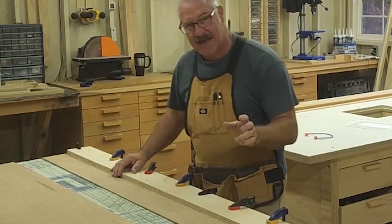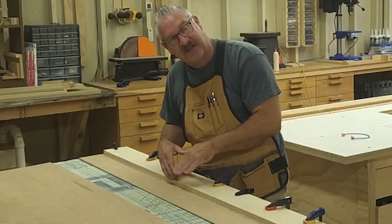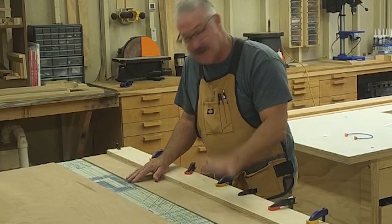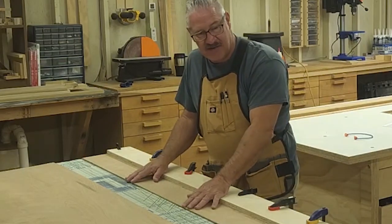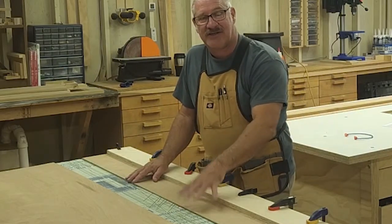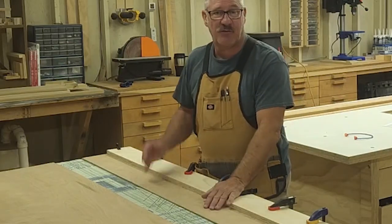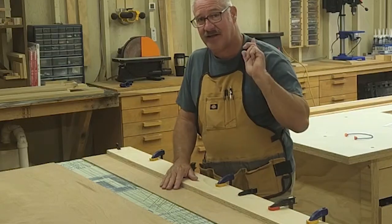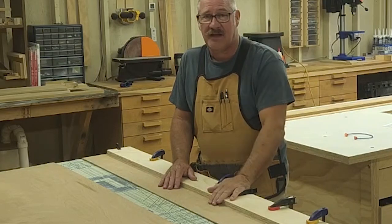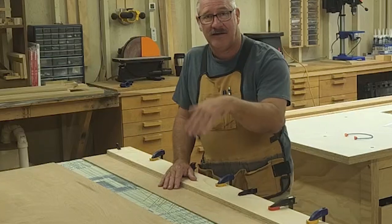While I was cutting that, I was making sure the saw was up against the fence and watching it really closely to make sure this is as straight as possible. We only get one shot at this to make this edge nice, straight, and perfect. If there are imperfections now, they will be transferred over to any sheet goods you're going to cut later. That's why I'm rebuilding this — the old unit over time had developed a bow, and when you're making things that are square, that's not really advantageous.